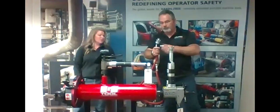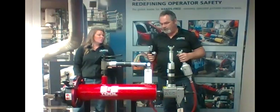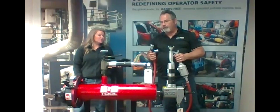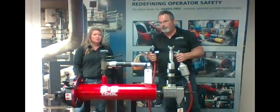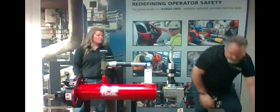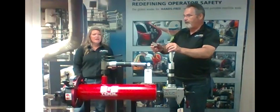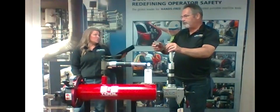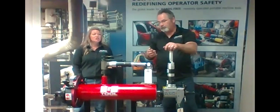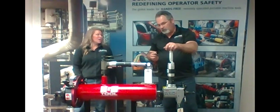I don't know if you guys noticed it, if you were able to join in a little bit sooner and saw one of our videos of our machine compared to a competitor's machine. One of the great things about our tooling is it has a really nice chip breaker on it. We make all of that tooling in-house. And the nice thing about that chip breaker is that, and John can explain it a little bit more, you'll see it actually chips the ribbon off before it gets to be at a dangerous level. John, you want to explain what kind of happened in your video?